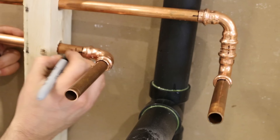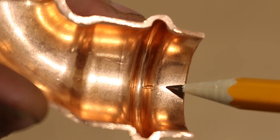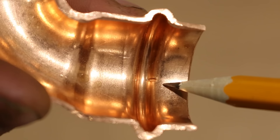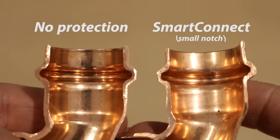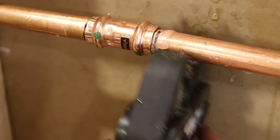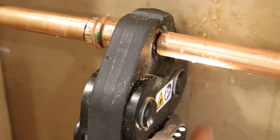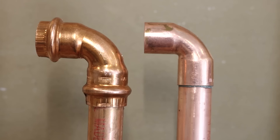At this point, I always like marking an X on each crimp as a visual reference to make sure I don't miss any. And finally, testing. ProPress fittings have a neat feature called Smart Connect which allows for water or air to leak out of the fitting during pressure tests. Some brands of press fittings don't have this feature and won't let either pass during tests, and would leak afterwards once the walls were closed up. These fittings could easily be identified by a colored mark on the fitting. An unpressed fitting can easily be detected with a water test and fixed on the spot without having to empty out the system, which is really neat.